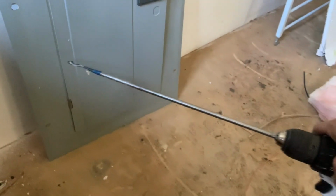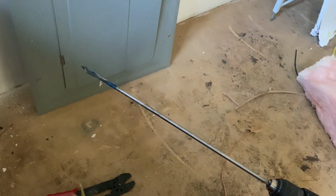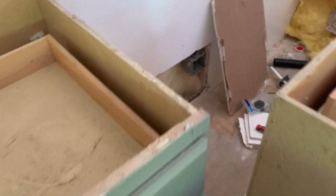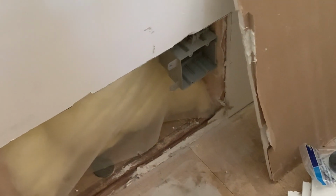And then we'll route this underneath the house. And then we'll use our handy dandy 3/4. We'll go through the 2x underneath. And we got 2x6 floor joist. And we'll plumb it underneath the floor. Tiny crawl space on this place. All the way over here. Up and in the double J-box there.